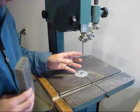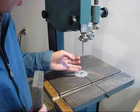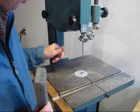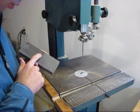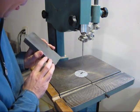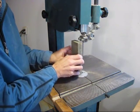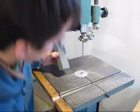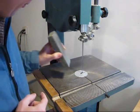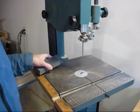Because I'd actually messed up my blade by cutting through a staple, it wasn't consistently dull. My first three experiments resulted in an inconsistent cut. What I did to straighten it out is to basically flatten all the tops of the teeth by holding a grindstone against the blade and just moving it back and forth while it's running. I'm not going to do that on this blade right now because this one's actually sharpened, so I don't want to bugger it up with a stone.